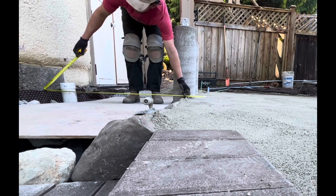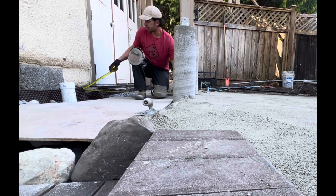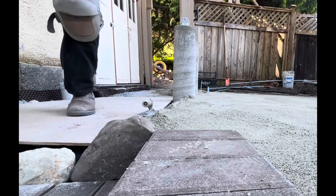So I'm actually going to pull some measurements off of the house. We could also just have our string line still set up as well, nice and parallel. But I like to make marks in the sand where I can to really get that first straight section going in the right direction right off the bat.